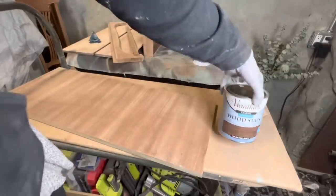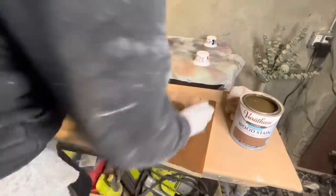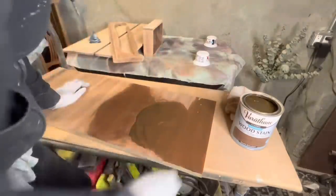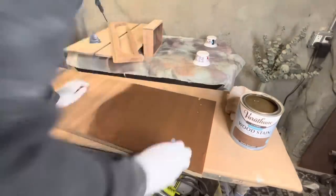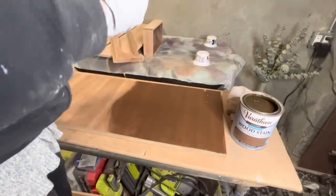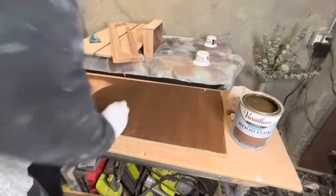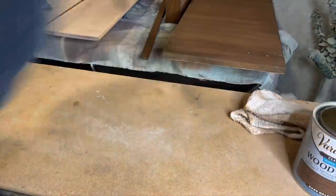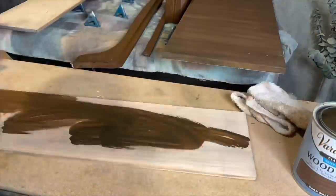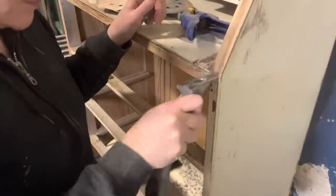As I mentioned, there were a lot of different kinds of wood, so I'm using dark walnut stain. I feel like it's not too dark, but it's dark enough to help the different species kind of match up. This underside I'm going to keep as solid wood on the drop leaves on the front — I like to keep those wood and just have the clear coat because I find they are better to be used as desks that way. You can see I kind of just set up an assembly line of staining — it made things go quite a bit faster.